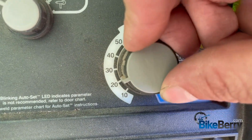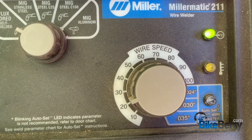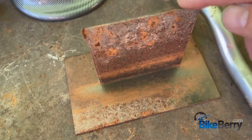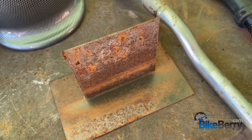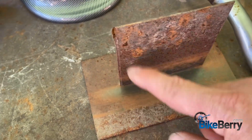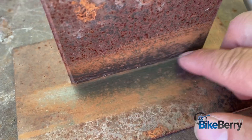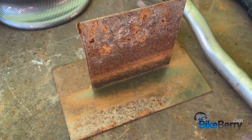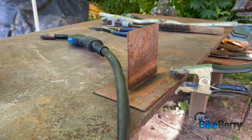My recommendation is to find some plate steel that's about the equivalent of most bicycle tubes — that's going to be 14 to 16 gauge around there. You're going to tack it together. We'll start kind of in between on the settings because a little too fast sometimes causes spitting — we'll adjust accordingly. This one is already stuck together; it was rusty, but I wire brushed out the crevice, and it's a good way for you to start learning how to weld a bead. To weld, you've got to have a grounding clamp on so it completes the electrical cycle, then we'll start welding.